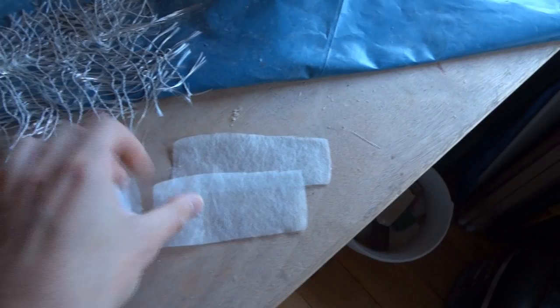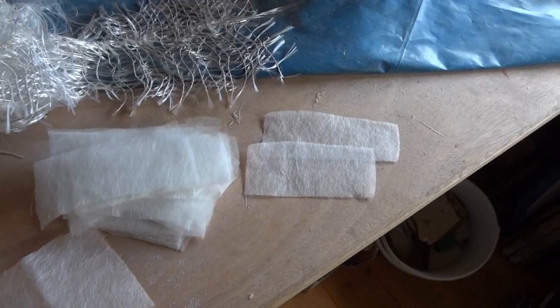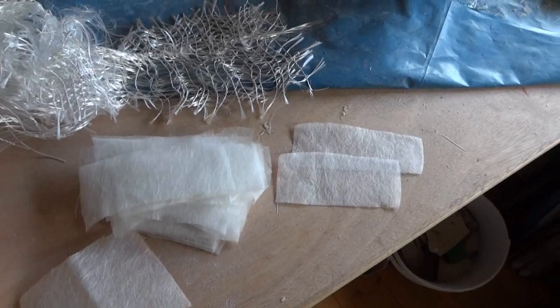Basically, the plan is to use minimal reinforcement with some very thin fiberglass. So this is fiberglass surface tissue, which is very thin, and it'll be very easy to wet through. So I'll do a coat of that. Then the plan is that we're going to break them out of the mould, cut them in half, because if you remember, my other pieces are all in two halves. So the shins I cut in half, so the backs and the fronts fit on separately, and they fit onto the strapping system. So that's going to be the same for the thighs.